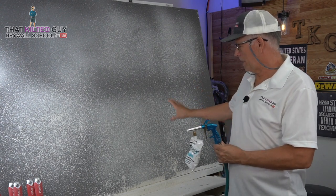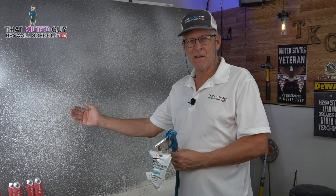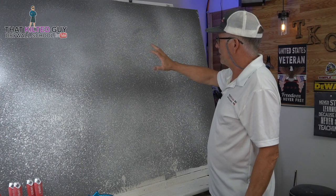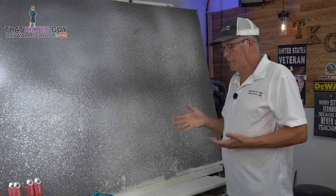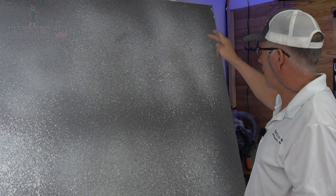Now let's hang on a minute — we've got to give this a little bit of time to set up. If you're doing a knockdown, what you generally want to look for is that shine to start fading. You don't want it to go flat. I'm going to show you a close-up picture here so you can see the shine on this — you might see it more if you look from an angle. While that's setting up, I'm going to show you a close-up of the fine, and then next will be a close-up of the medium. I can tell you that I think I can spray a little more evenly with my texture hopper, but for these small repairs I think this is going to work great. Plus, this is only my second time using it — I really think it takes a little bit of practice to get the even spray down. And here's a close-up of the heavy, and then a close-up of the one I got ready for a knockdown.